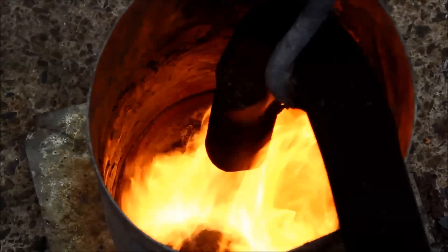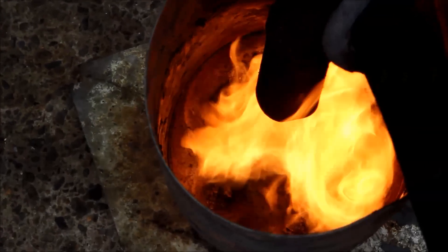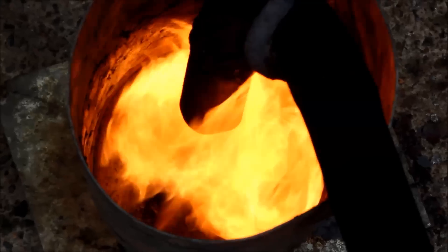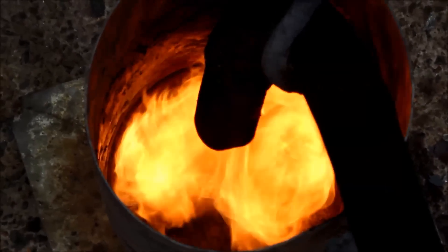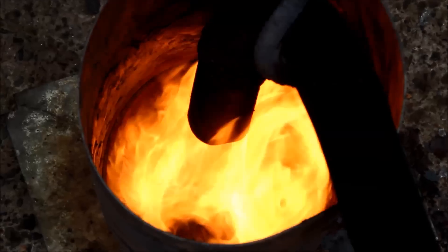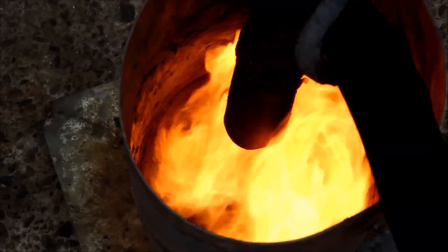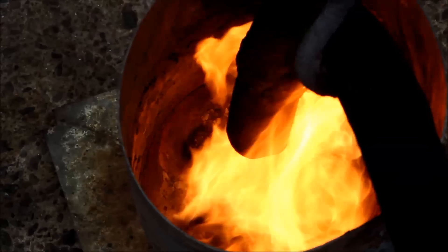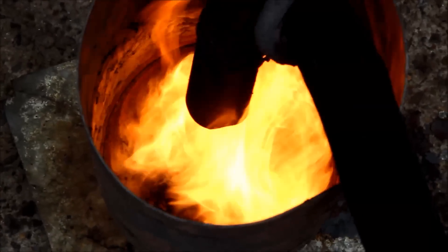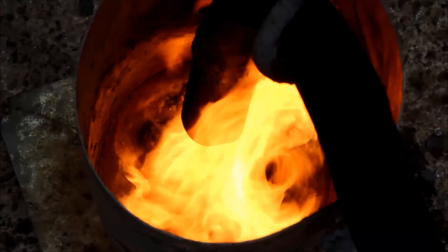I've moved the tube around a little bit just to give you a different view of the flame front. It's still vaporizing somewhat in the air tube, which isn't a bad thing, and it is dripping a little bit into the burning chamber as well. All up it looks like this works and it is a successful type thing. I will have to do a bit more playing with it just to see how fiddly the thing is. I did have a bit of trouble getting it lit but maybe that's just not being used to it — it definitely seemed that the rag method worked the best, allowing the oil to wick up and the burning chamber to get up to heat before getting right into it.